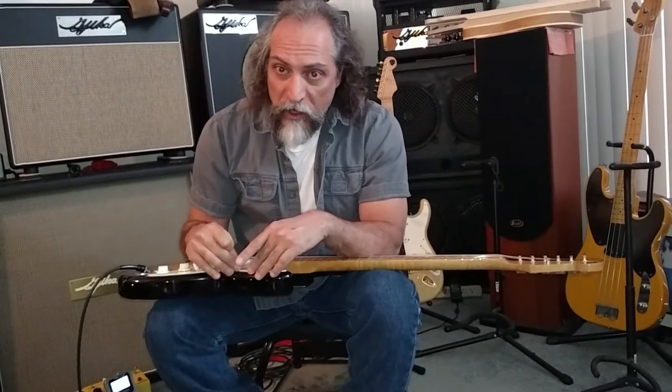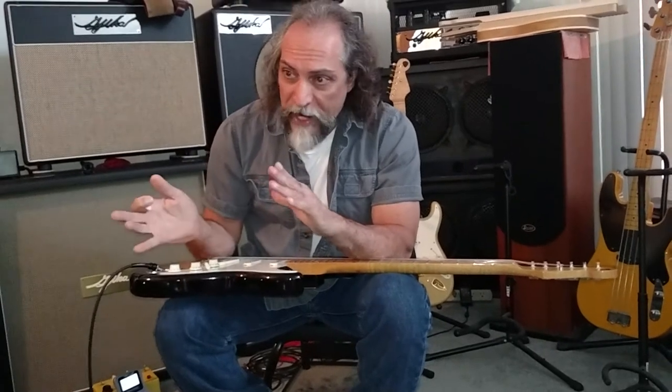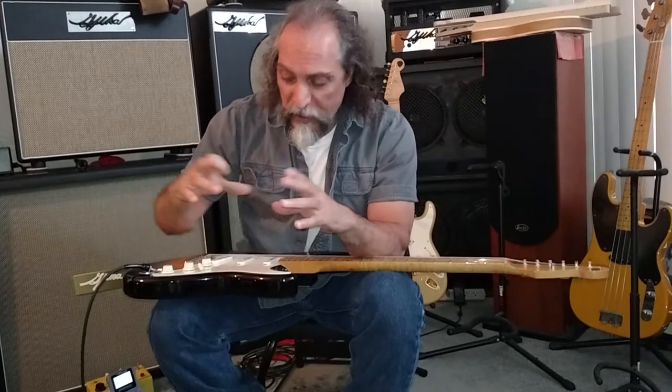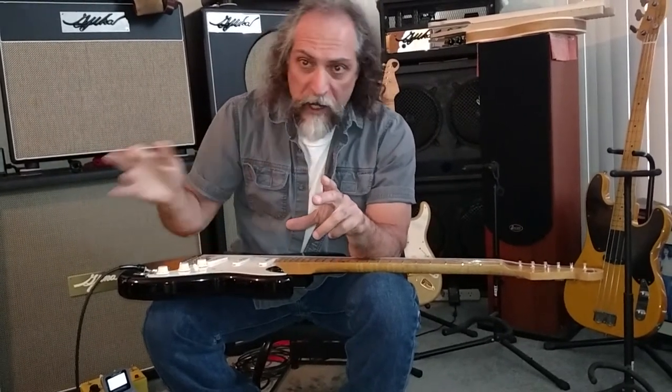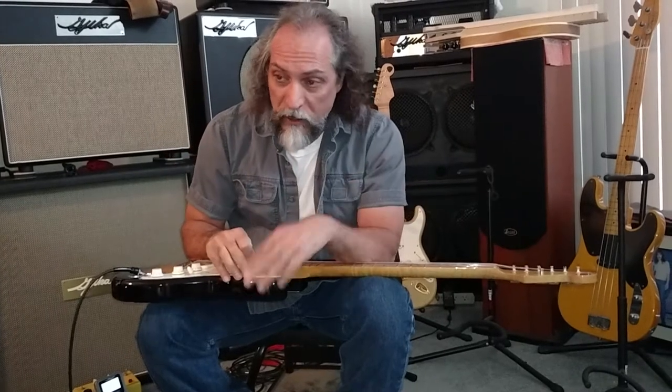So it's very important with old amps. My amps are wired for 120. So even with my amps, if you've got 126 or something coming out of the wall, you really need to check that. Now, there are expensive devices you can buy that have 10, 12 isolated outlets and control the voltage wherever you go and keep it at that. If you can afford that, buy that. Furman makes them. They're pretty good.